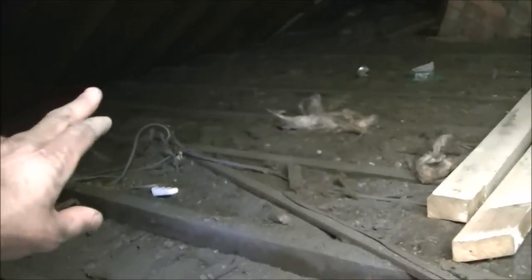Just for reference, going around the attic — you can see I've got the purlins there. Strange setup on the purlins: they've only got one support in the middle and one there in the middle. You can see that between me and next door there's actually a gap either side of the chimney breast, so I'm going to have to brick that up. Once I've got my strong joists in place I'm going to support the purlins onto the joists, which will then be supported by the three load-bearing walls — the outside wall, the middle wall, and the other outside wall. We'll do the same with that purlin, and I've got a purlin just above my head here that goes all the way along.